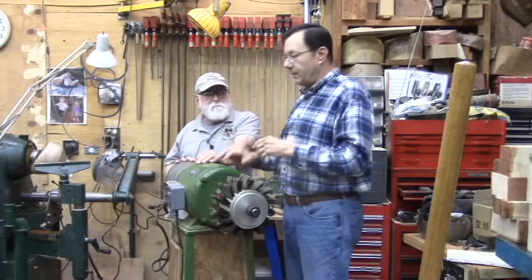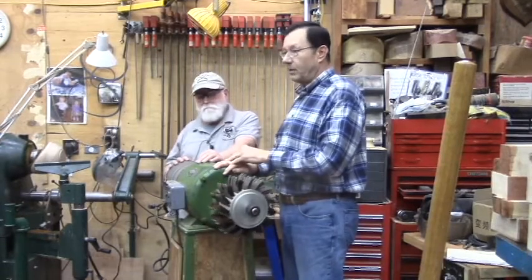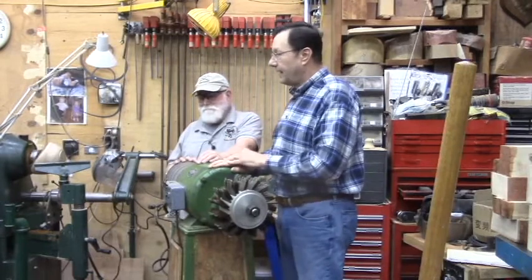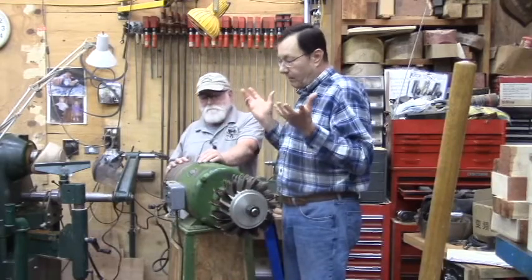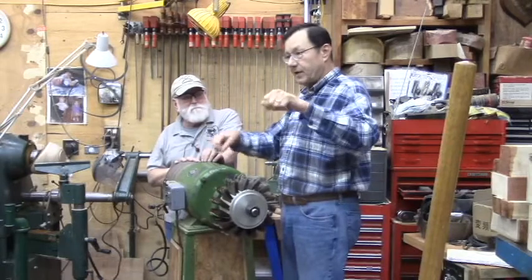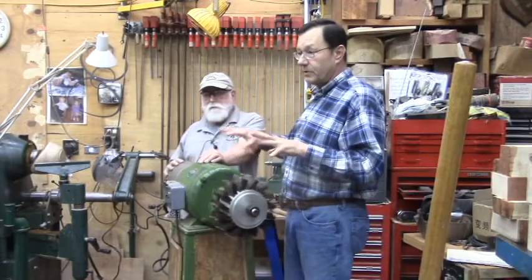As I dug around and talked to some electricians, they said, did you bond your VFD to the machine? I said, well, no. Why would I do that? It already had a ground wire there. The odd part was I had originally set up to do that. I had a pigtail set and everything. I just didn't do it, and I don't remember why. But after I set the ground there and did the checks, everything was clear. So if you do install one, make sure you bond that unit to your frame so that everything is grounded and bonded.